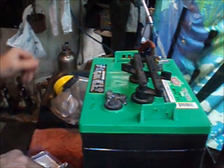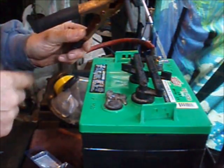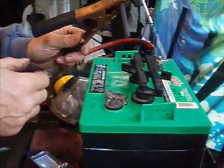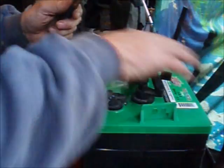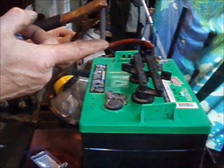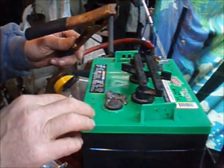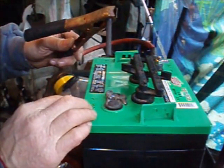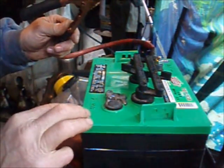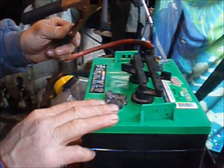The key here is carbon — it's called carbon gouging, or carbon welding, there are all kinds of names for it. What you have is a chunk of carbon and a power supply. When you short it out, the carbon heats up sufficiently to melt the lead. It doesn't require flame, but there is potential for sparks, so you want to make sure everything is vented with good fresh air flow, because batteries do explode.